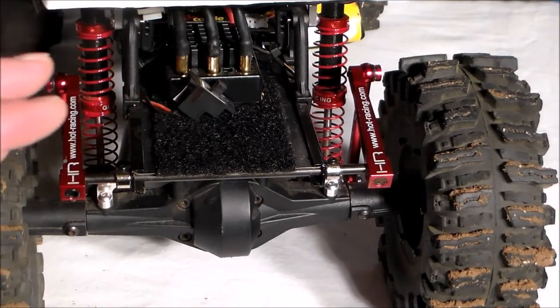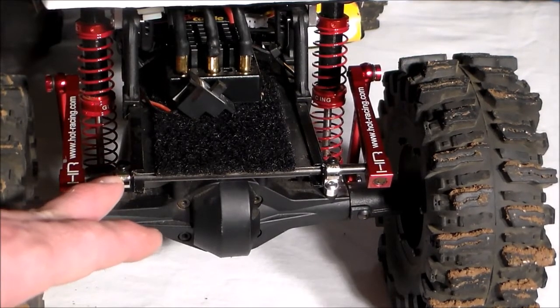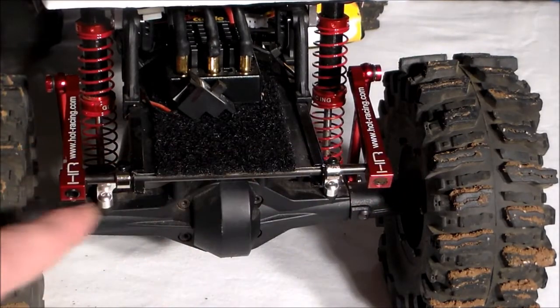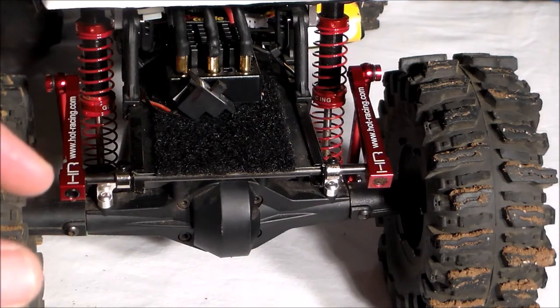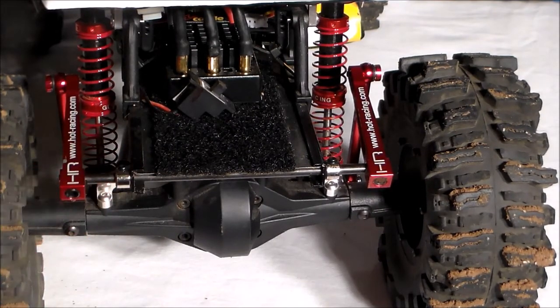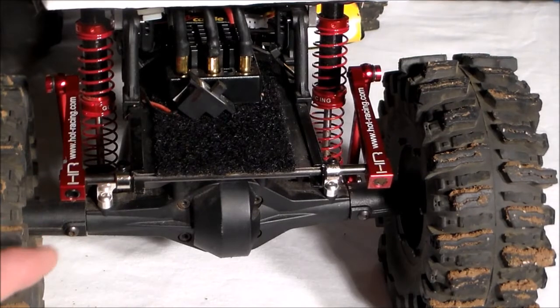When you're ready to put this thing together, if you don't feel confident, you can mock this up with a little brass rod - that's what we did when we were figuring out the measurements. If you are confident, just jump right into it. Once you get your bar cut and your holes are drilled, slide that bar in there. You're going to have to put your collars on. They'll go right over that ground spot fine. When they get to that lip where the bar goes back to full size, you'll probably have to take a pair of needle nose and just tap them past that little lip. Once they're past it, they'll travel back and forth smooth - virtually little to no play, they fit really, really nice. So when you have to grind for your collars, you're going to do that after you get everything bolted together.